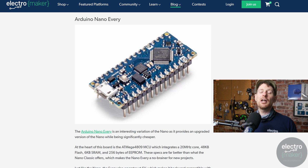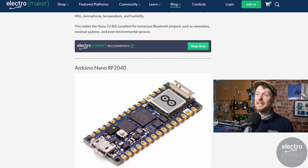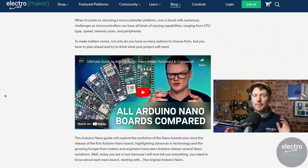I'm not going to talk about the original Arduino Nano because the Arduino Nano Every replaces it. It's a 5V tolerant board with a better Atmel chip on it and it is cheaper than the original Arduino Nano. So if you need a drop-in replacement, this is the one you'll want. The Arduino Nano Every is the only backwards-compatible Nano they have now, whereas the Arduino Uno R4 is backwards compatible thanks to the new Renesas chip on it — a 32-bit, much more powerful controller that is also 5V tolerant. The "33" in the name of all the other boards means 3.3V, so don't mix those up. Robin's article is fantastic — I'll link it in the description.